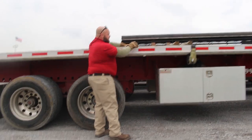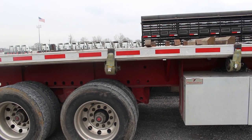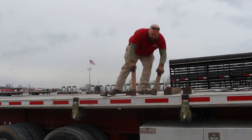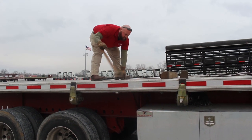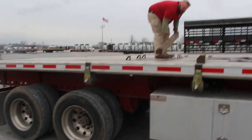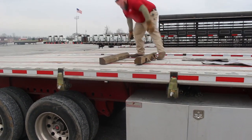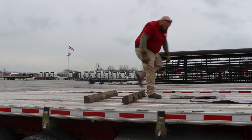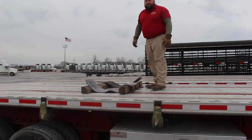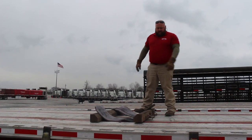That's going to be the front part of our rack for our rear coil. You want to make sure your two outside full racks are laying on the wood, because that's going to give you a lot of friction. You want to make sure they're spread out and tight against the rack. Lay your padding right in the middle. Watch out — if the crane operator sets that coil down on one side of the board, it's going to move.